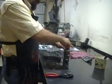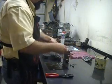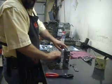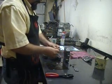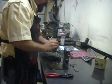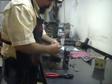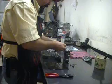Our lock-up relay valve is going to be underneath this plate. On some models, this valve is going to have a spring just like this one, and on some of them it's going to be without the spring. Let's go ahead and install our new one — put a little assembly lube to hold it together, drop it in the hole, and go ahead and put our cover back on.